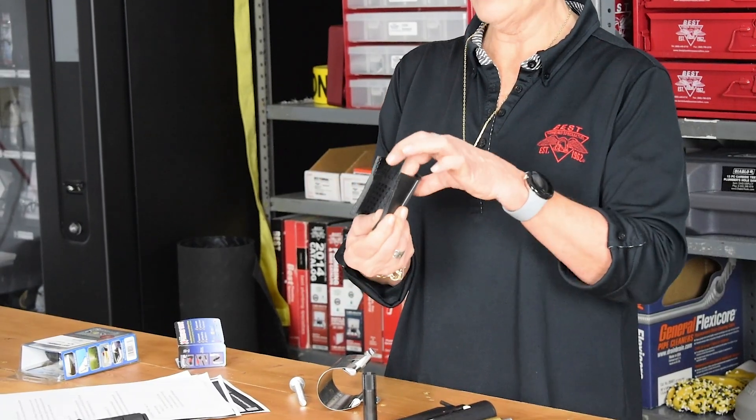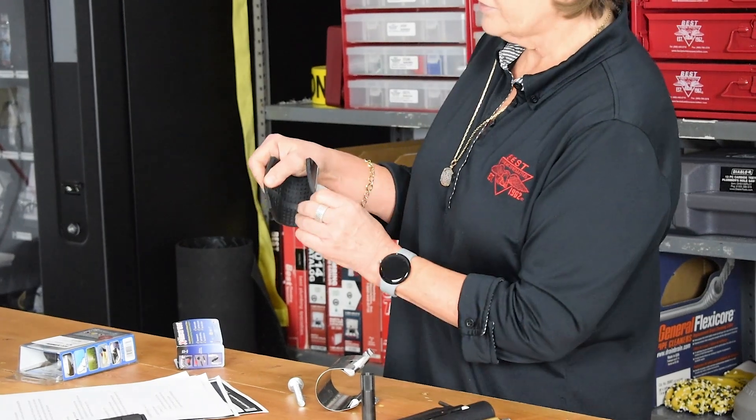These are specifically designed with a beveled rubber baffle inside the clamp. When I say beveled, it's got a ridge in there which is designed to seat right up against the solder joint to seal it. So imagine you have a straight pipe and an elbow that's soldered on — if the solder fails and that's where your leak is, that's what these are for. You seat it right up against the joint, put this on the opposite direction, and it creates a 360-degree seal. Simply put the bolt on to tighten it down. You might get a little wet but you've fixed it in minutes and you're going home.